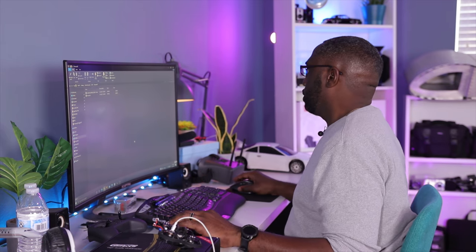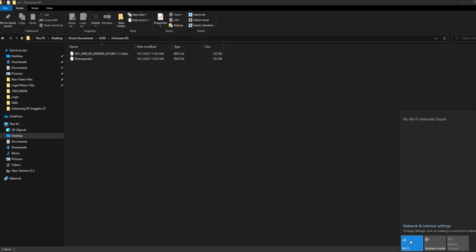The only way to power this receiver right now is via USB-C — let's plug it in and see if it powers up. I don't have a smoke stopper in this small PH 2.0 size, but typically I'd use one before powering up after repairs. I'm pretty confident there are no shorts, so let's try it. The receiver is powered — there's a blue light. After 20 seconds it should go into Wi-Fi mode. It's steady blue and in a few seconds it should be flashing fast. That's a long 20 seconds — I don't see it flashing.